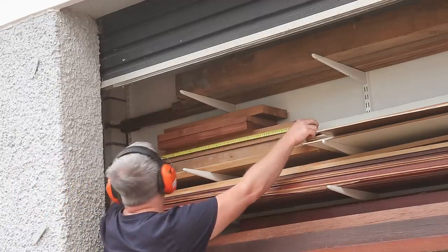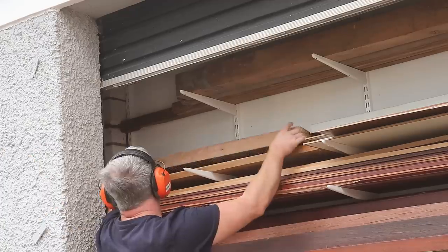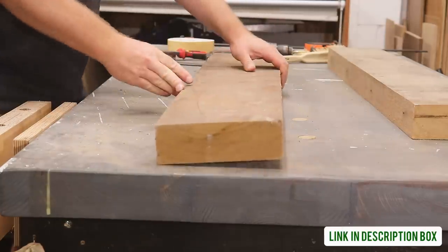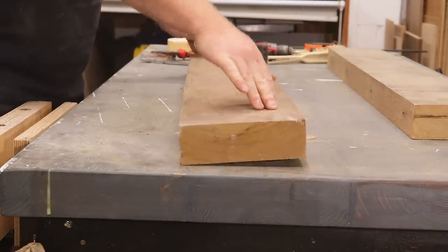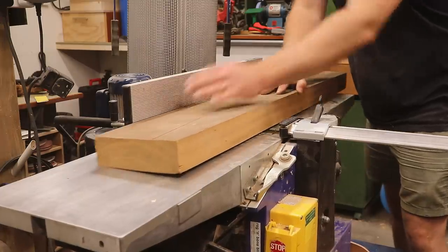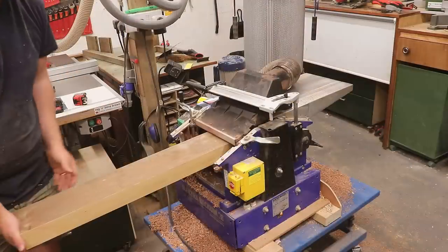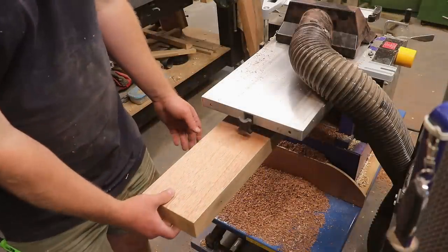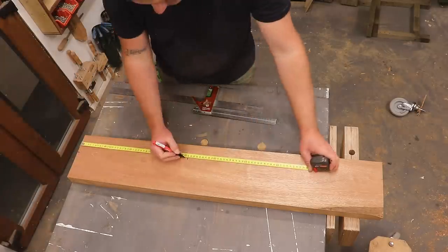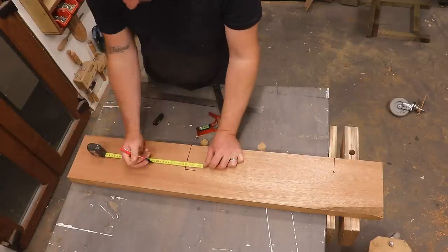I'm going to make a brand new frame for this bench and I have some hardwood that I salvaged from an old church refurbishment many years ago — some of you might remember that from my first ever vlog video. As you can see these bits are a bit warped so I need to mill them flat again using the planer first and then the thicknesser. I chose these pieces because they're nice and wide so I can get the two long legs I need out of just this one workpiece with some careful laying out.